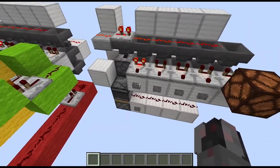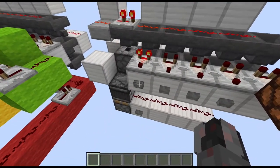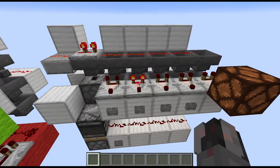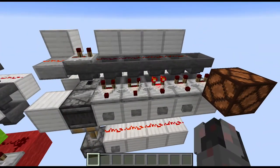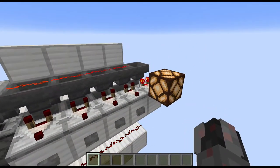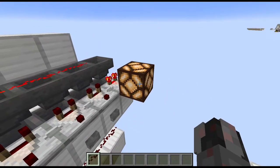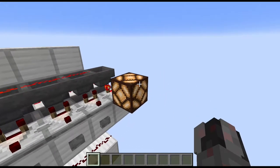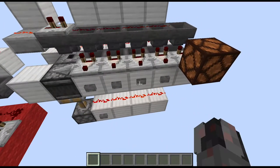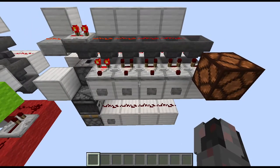Let me show you this without the button panel. Basically we have those buttons here — in this example just 4 in the combination, though as I said this can be up to 13. I can see if I press the corresponding button, I can advance the item in this hopper chain here. And once it reaches this last module here, the output is turned on. If I press any of those other buttons, the system will simply reset and that's it. So that's the general idea of this design.